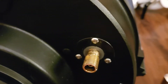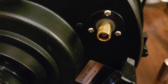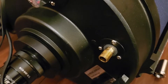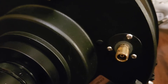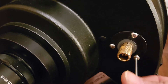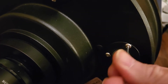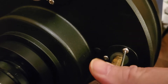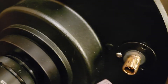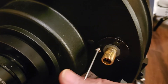I've measured this shaft. The diameter is somewhere around 12.7 millimeters. So that's important, and we'll get to that in a minute. Now that we have the focusing knob — the external knob — off, we're going to remove these three button head screws that hold in a circular plate that surrounds the brass screw connected to a shaft. That moves the mirror inside the telescope tube, thus getting the desired focus.